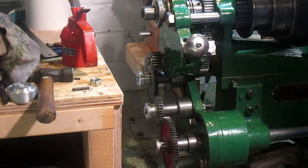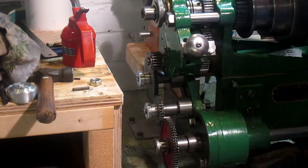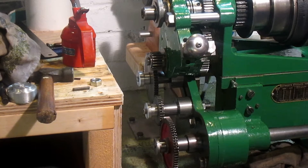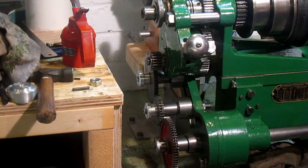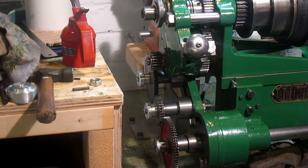We're slowly getting there. I've got everything up to 220s now, and I've been drilling them out because they were 5/8th. I think they were 5/8th — I've drilled them out to 3/4. Filed the keyway in there — I've just hand-filed them. And that fits nice.